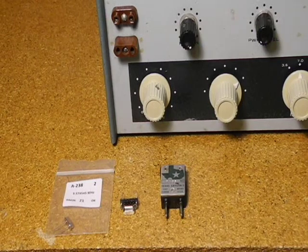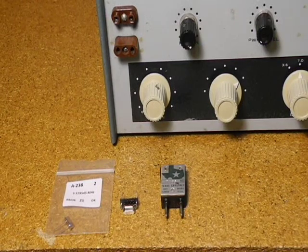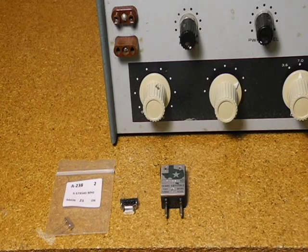I had a 40 meter crystal that worked. For 80 and 15 meter operation and for alignment, I needed an 80 meter crystal. I ordered a low cost 3.579545 MHz TV color burst crystal from a supplier on eBay and made an adapter to fit the crystal socket. This allowed me to get on one or two frequencies on each band and test and align the unit.